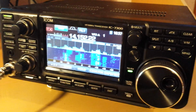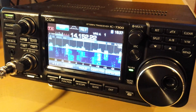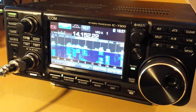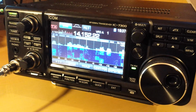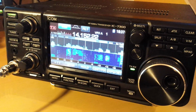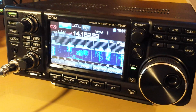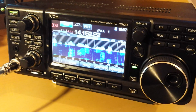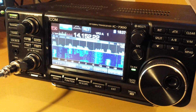My problem so far was that I had a really bad antenna, so I put up something really quickly today, a random wire, give or take 6.5 meters, as I said, through the ATU, and that's what I get. It works easily from 40 meters upwards, and actually I think 80 meters would tune as well. I'm using currently reduced power, but no issues. Contest is going pretty well. Maybe not many contacts, but those that work are just fine.